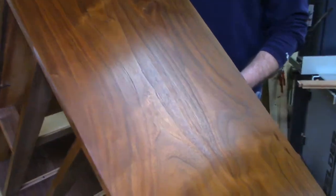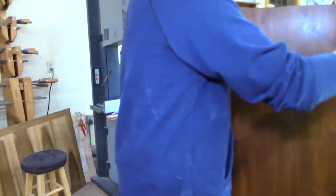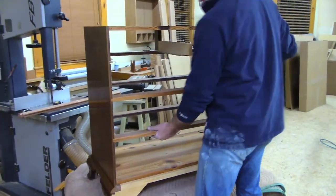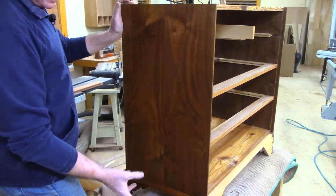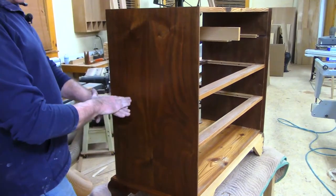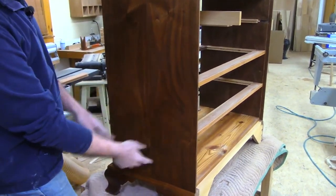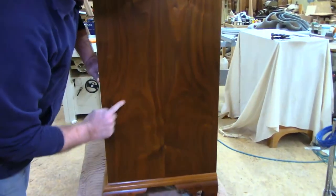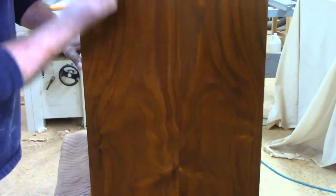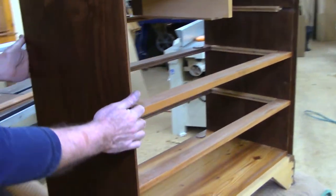Look at that — it's gorgeous. The color is rich and it has such a beautiful feel: really elegant and first-class without being overly stuffy and shiny-formal. It has a really nice warm glow. This side panel is book-matched — consecutive boards from Pugmore's attic, sequentially sawn. After planing them flat I book-matched them, so you can see the pattern mirrored on each side. You usually only see that with veneer, but here it's solid wood.